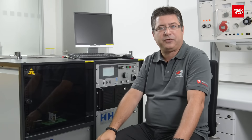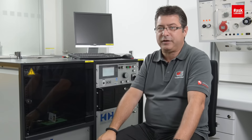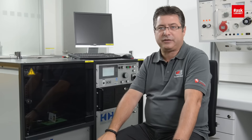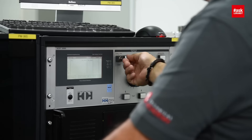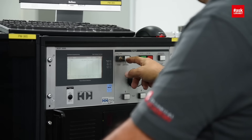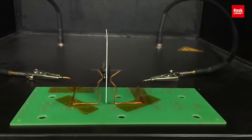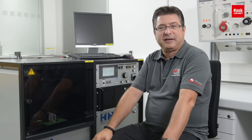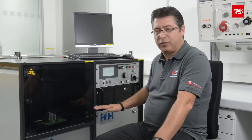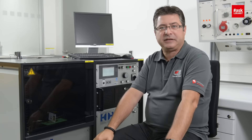What will happen if I put the card completely between the electrodes so we have a good isolation? Will there be any spark? The maximum voltage the generator can do is 10,000 volts. Like you can see, this time there is no spark. Plastic is a very good isolator, and the maximum voltage the generator can do is 10,000 volts, so plastic is excellently isolated in that case.